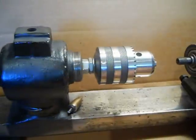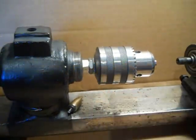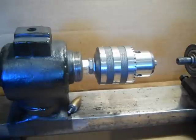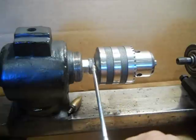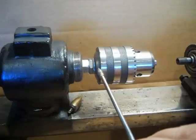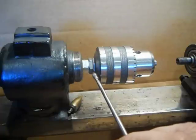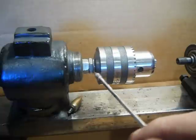I had to make a taper piece. On a bicycle, you have a long nut — it has the nut and then a long piece of metal. I tapered it to fit this because this is a tapered chuck. There's also a little nut brazed in there so you can put a screw in here to hold the chuck on it.